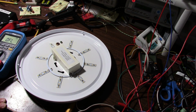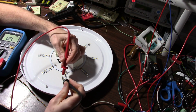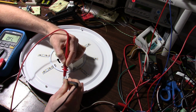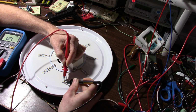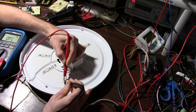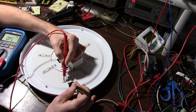One moment, please. Okay, so I removed that screw, and the best I can get is open. I think I was just shorting on that screw or something. Maybe it's grounding out or something like that. Hopefully I'm getting this on the camera without blocking it. That's where an overhead camera mount would be really handy. Yeah, so this diode here is open. Perhaps a bond wire failure.